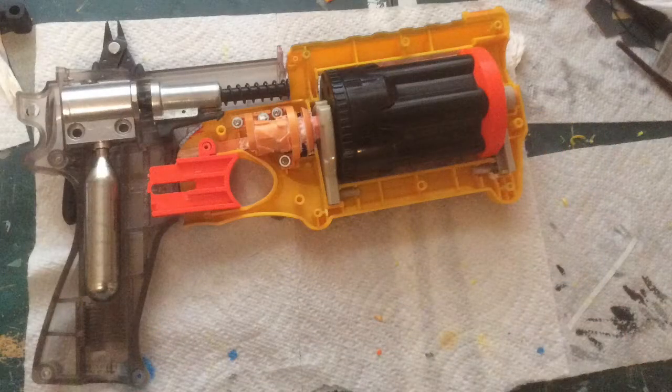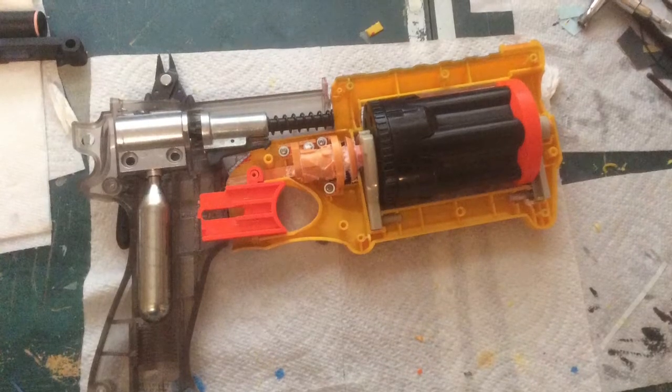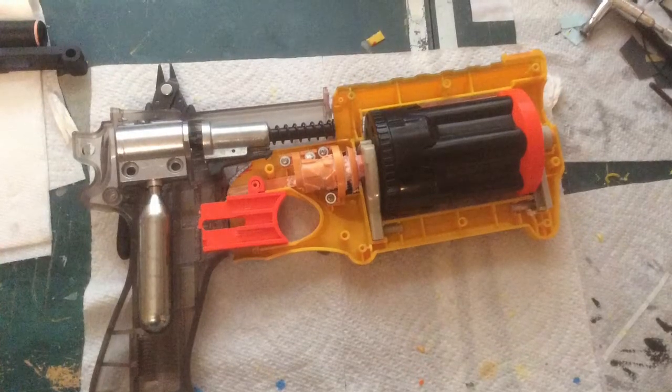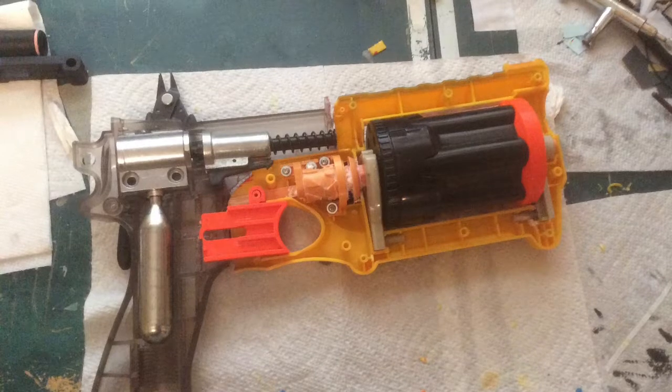After disassembly, the first step was to cut them apart and start fitting them together. You can see where I cut each one in half and started fitting them together. Basically, combining the two units together on the inside, I did a combination of using epoxy and using a heat gun to try to plastic weld them together, which actually worked pretty well. On the other side I put down a layer of fiberglass and resin, sanded that smooth, and then used Bondo to smooth it all together and blend it in.